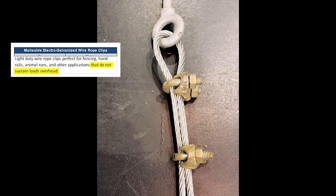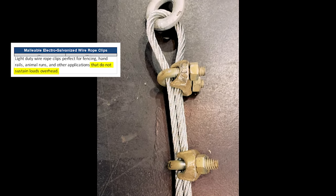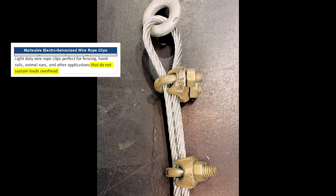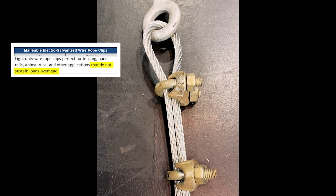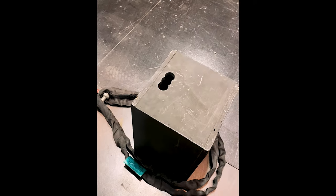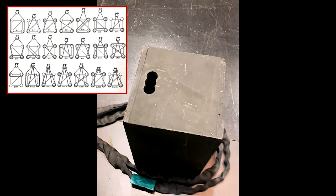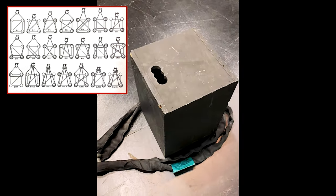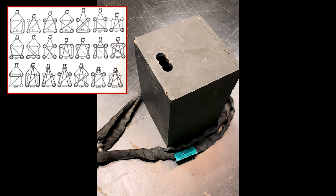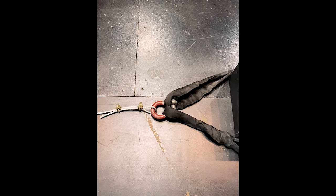So it's no to malleable clips across the board. These were just pulled off some old rigging for this demonstration and will be discarded. Everything was wrong except for the span set attached to the truss — it was one of the preferred methods and looked like a good strong hitch. It just failed at the shackle point. You've got to turn that shackle around: the two legs of the span set should never be tied into the pin.